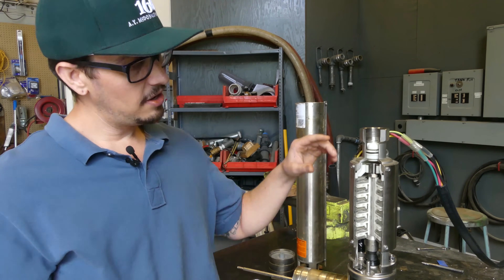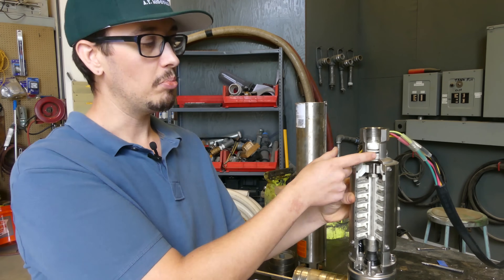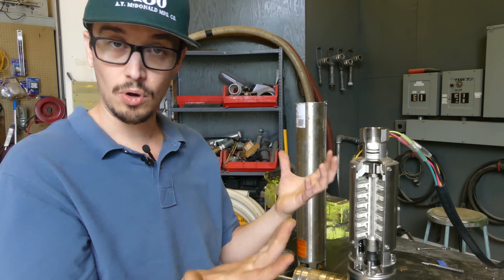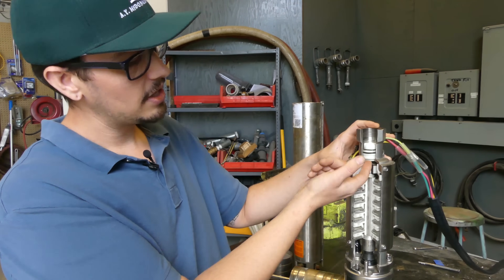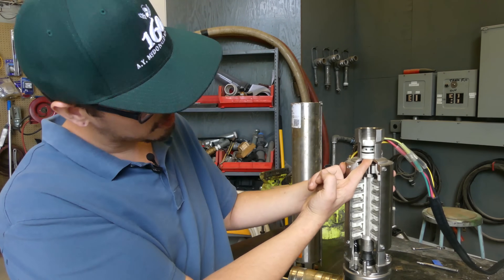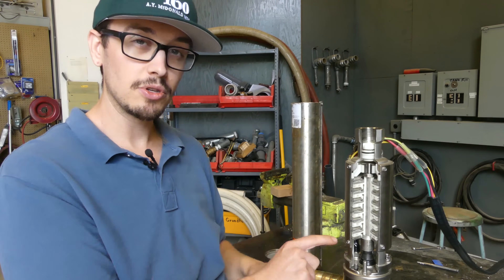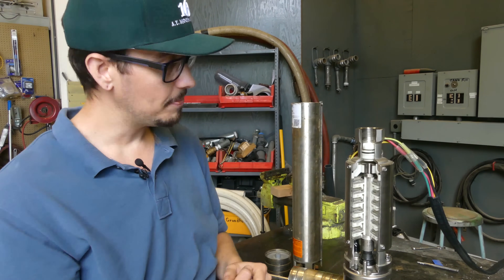In well pumps from 5 gallons a minute up through 25 gallons a minute, you will often have a built-in check valve. There are a lot of different ways manufacturers do that. Grundfos does it with just a small stainless steel disc that when the pump shuts off, the disc just drops down and covers a hole — not super scientific, but it works as long as it's machined properly. This one here is what I call the poppet design, where it's just got a little poppet that is pushed up by the flow of water, then falls back down and rests on a relatively thick O-ring to prevent backflow. The reason you want a check valve is that without one, water will flow in reverse causing the pump to turn backwards, and if the pump tries to start while turning backwards, you could potentially break the shaft.